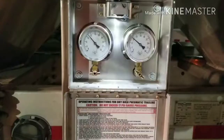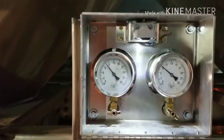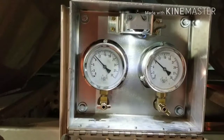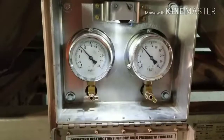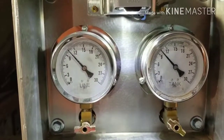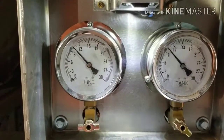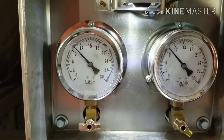I'm moving it around a little bit — I opened up the pod just a tad and my line pressure is fluctuating, going all the way up to 11. When that happens it's going to start to build your tank pressure up to 10, 11. Right here you can see the pod I have open is cracked just a little bit more, and that's the result. You're now looking at 10 psi on the tank, about 10 and a half on the line. That fluctuation is telling you there's too much sand going through the line.